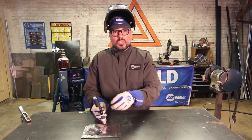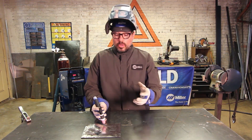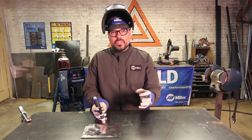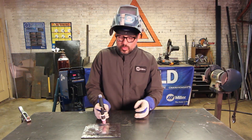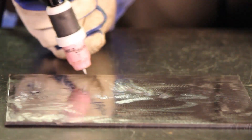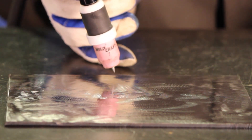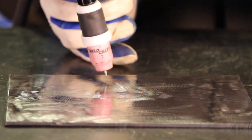You want to concentrate your shielding gas on that puddle, hitting it evenly. Next is your push angle. In TIG welding, it's primarily push — you're very rarely going to be in a situation where you can pull. If you're right-handed, you're going to push left; if you're left-handed, you push right. For a right-handed welder, drop to roughly a 70-degree push angle.